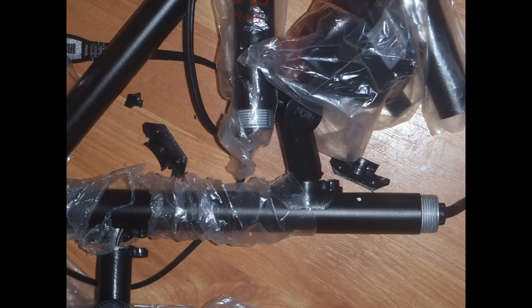Clearly, the metal sections of the rod had just been bouncing around inside the foam block as the unit was shipped, bashing against each other, and this had resulted in 2 of the 3 lamps being broken from the pole. The design called for the lamps to be attached to the top section of the pole via plastic pieces. These plastic attaching brackets were quite thin, of complex shape, and made of a type of plastic that appeared to be extremely brittle, with the result that impacts during shipping, presumably from other sections of the pole, had completely shattered 2 of these pieces.